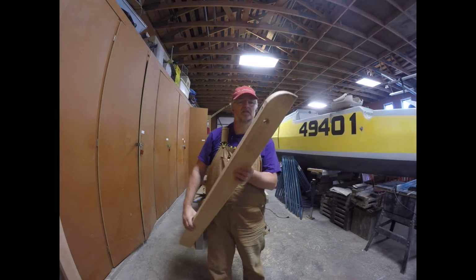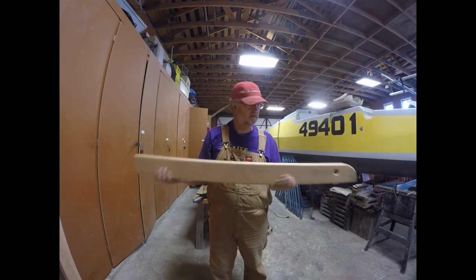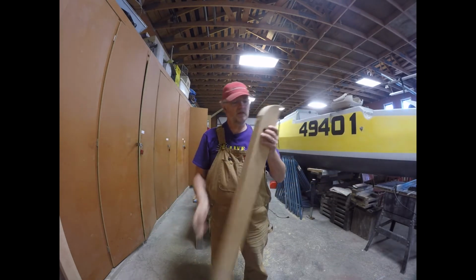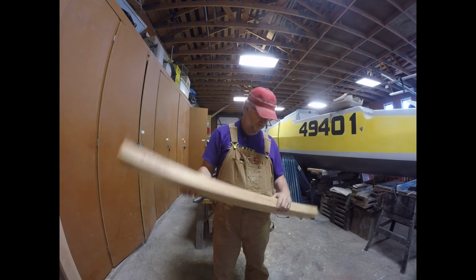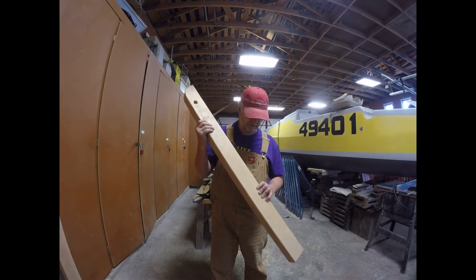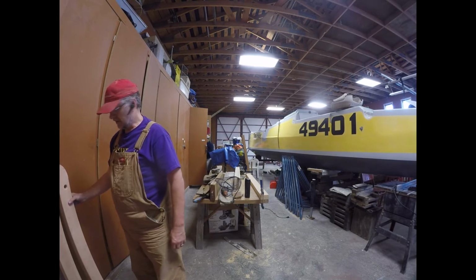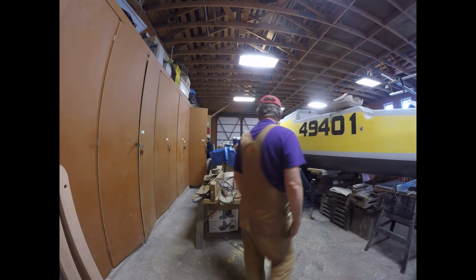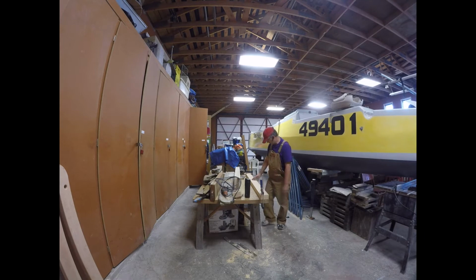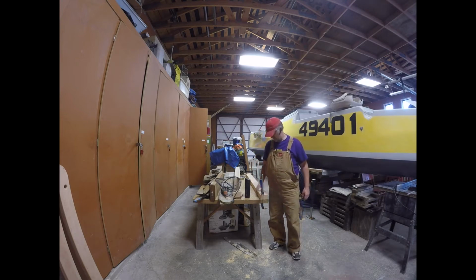Well, here you have a sampson post, drilled, milled, cut, fit, ready to install, other than a little bit of finishing. Got to do some sanding, and then I'm going to put penetrating epoxy on it and some varnish, and it should be ready to go on. So next on the agenda is the boomkin. I've cut my boomkin pieces to length, and I'm going to bullnose the edges. They're quite sharp, and if they get knocked around, they'll splinter. So to prevent that, we'll bullnose them. And then need to make some cuts on that and drill some holes on that.